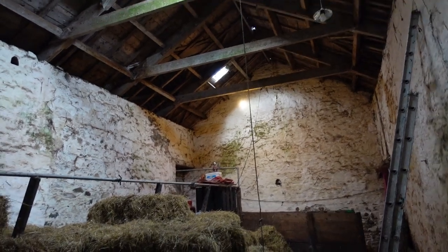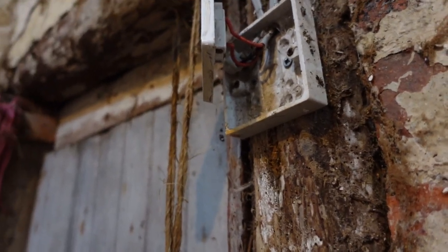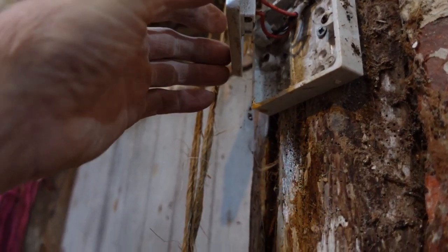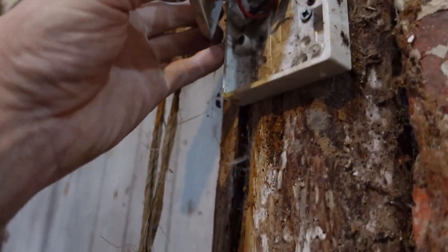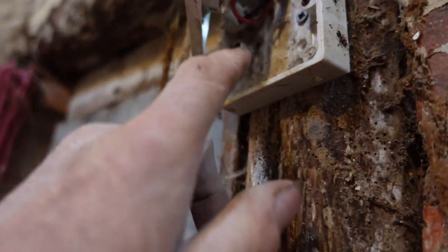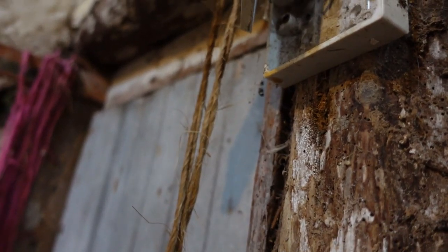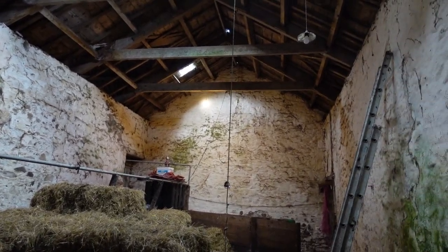Quite interesting really — I'm quite glad it happened. The answer is to rewire the old buildings, and that's not going to happen immediately. But if I put that switch box a little bit higher and leave those down-swept bends in the wires, any drips of condensation that run down the wire will drip off rather than going into the switch. I hope so. I hope you found this interesting — thank you very much for watching.